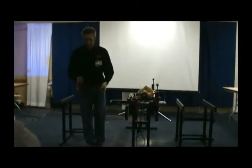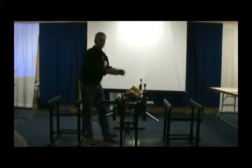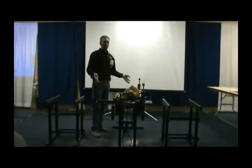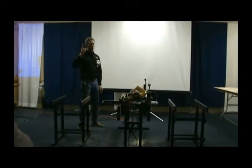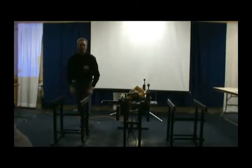So, comes with the machine is a trigger lock. Did anyone notice this on the saw? Probably not. But it's sort of like, how do we get this thing held while I'm pushing this through? The machine comes with a trigger lock. So now we can do any kind of rip cutting we want. This machine is designed for full 4x8 sheets. It's also designed basically for one person operation. That's the reason for the height. You lean your sheet up against the stand, and boom, you lay it on.